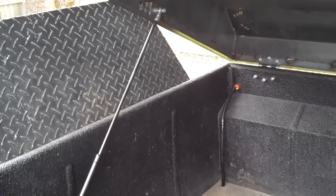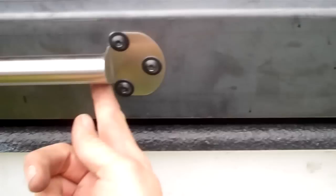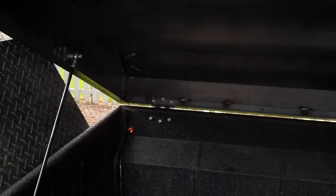Now I have two 225-pound gas springs off McMaster-Carr. They're the 8mm version, around $21 a piece. I don't know the part number, but they are the longest ones for around $22. The 225-pound spring rate. So those work well, one-handed, a little bit of muscle, comes down and stays down just barely. Spacers that I use are off my drop-down tailgate kit that I sell. I have one there, right down there, as well as two on the opposing side, right there and right down there.